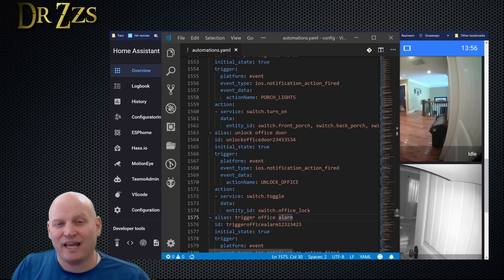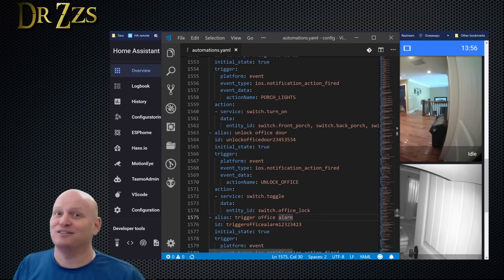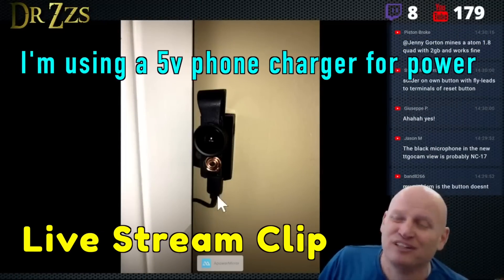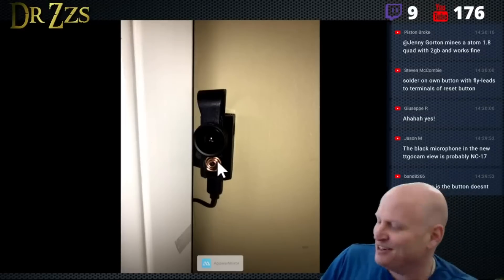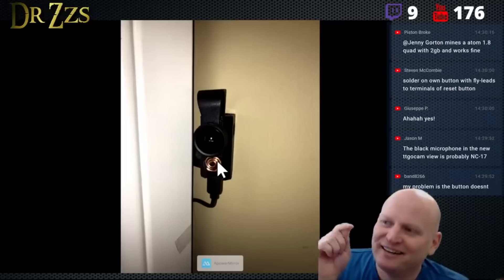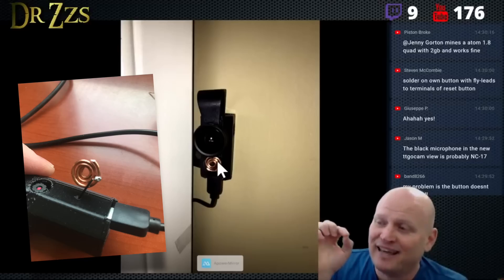Just to give some additional output, I also set it to make an announcement over my Amazon Echo, so if I'm sitting in the office and someone rings the doorbell I'll know. It's also good for them to get audible feedback to know their touch of the doorbell has been acknowledged. I also set it up so that with the video feed I get actionable buttons. I changed one of the buttons to give me the ability to toggle the electronic lock on the office door. So if the kids want to get into the office, they can ring the doorbell, I'll get the notice on my phone, and I can push the button to either let them in or lock them out.